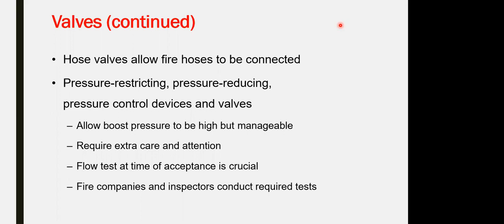Not only this one. When civil defense comes for inspection, you have to prepare a sample room. Sample room like this one, gathering all the drawings for the firefighting system, the approved drawings for the inspection, printing one set, A1 size at least: fire alarm, life safety plan, firefighting, emergency lighting, collected as one set of all, in addition to the site plan and the evacuation maps.